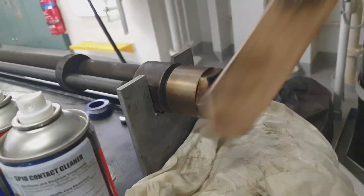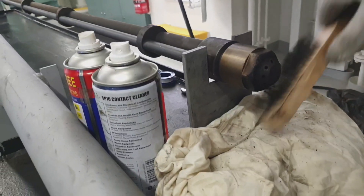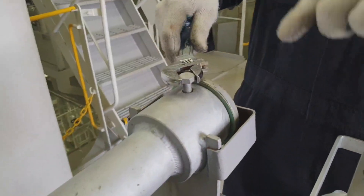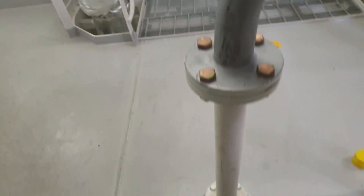Then I have to mount the burner again to the overhauling stand of the main burner. I am partially removing the carbons and the soot accumulated from the atomizer tip, or the atomizer itself.